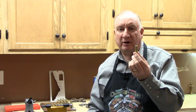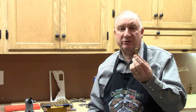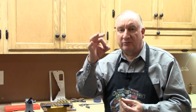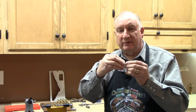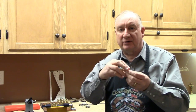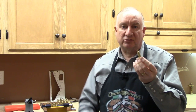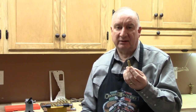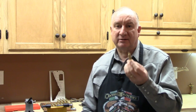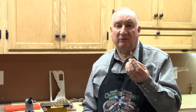During the cup and draw process, they take a sheet of thick brass, which is punched out into coins. They basically punch it out into round circles, and then through progressive punching over mandrels it is drawn. It is first formed into a small cup, and then is drawn and drawn and drawn repeatedly, and then finally stamped with the rim and all these dimensions that form it. That all hardens the brass like crazy. That repeated hammering of the brass and drawing of the brass hardens it. There's no softness that would allow the brass to conform to the chamber. It would be very, very brittle.